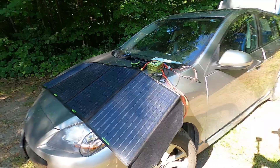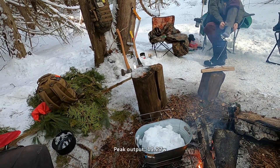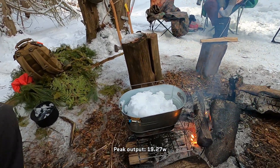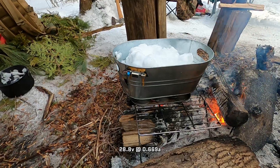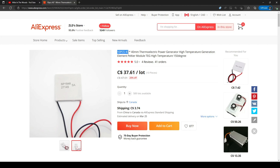To me, this is definitely the most interesting way to generate power on the go, compared to the other options: hydroelectric, solar, and wind. My little DIY build here costs 30 bucks to make and its peak output is 20 watts — that's 28.8 volts at 669 milliamps. This whole thing only weighs 888 grams, and if you stick two of them together that's a peak output of 40 watts. Building these things is dirt easy as well — you basically take six TEG chips off of AliExpress.